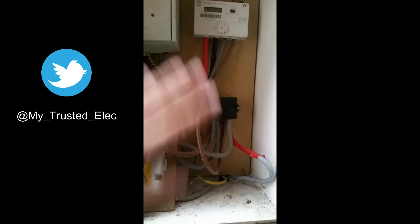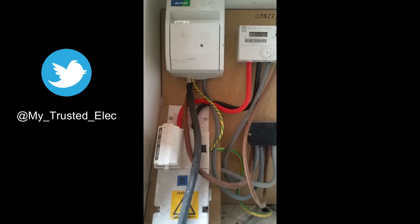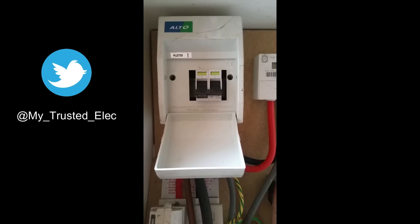But that's nothing. Are you ready for this? Now that goes into here, so it's feeding the socket here. I know maybe like a 20 amp, 16 amp sort of MCB - you're going to go, oh there's no RCD. You're really not. That's kind of worst case scenario you'd be thinking. No. We have nothing. We have a 60947-3 isolator which doesn't give a damn if it's using too much.